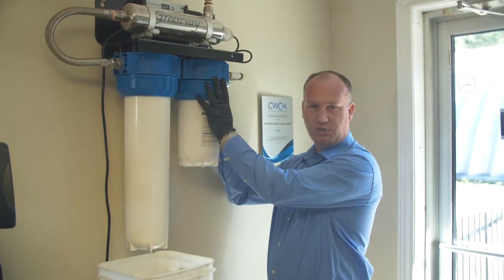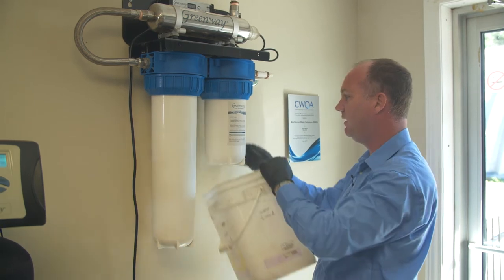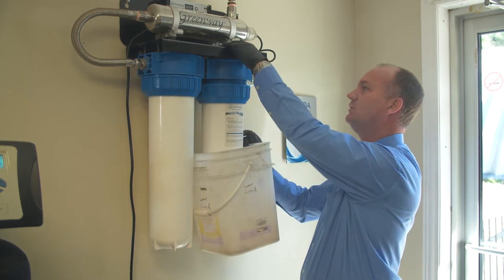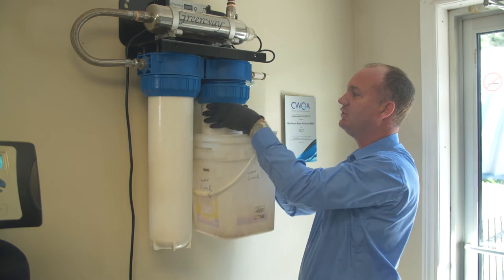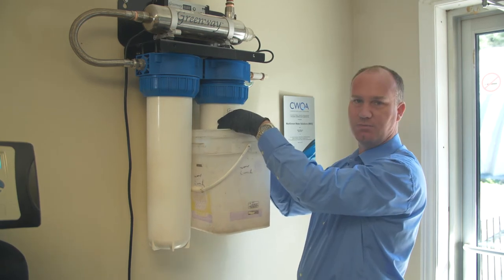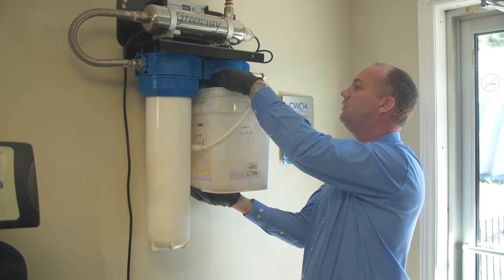With these particular ones, a wrench does come with them, but usually you can do it just by hand. So I unspin it and I don't take it off all the way. Sometimes I like to hit that button and move it side to side — as you can see, it's dropped and the water's coming out. The nice thing is you don't get that rush of water; it's draining as I'm doing this. Once it's drained satisfactorily, unspin it.